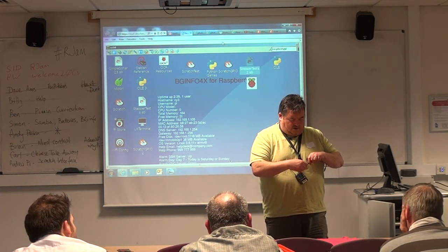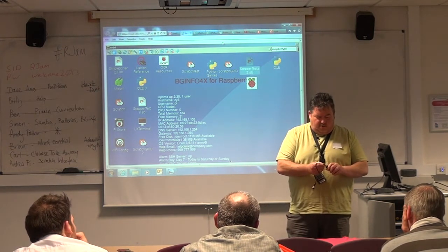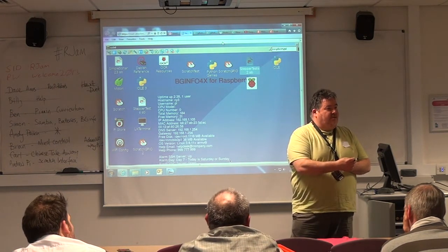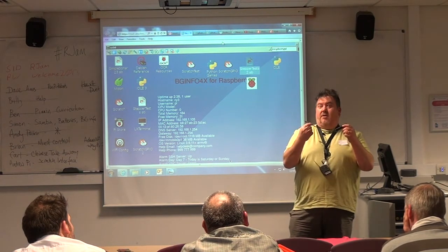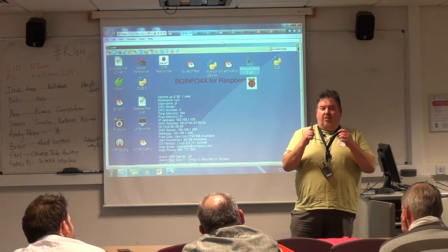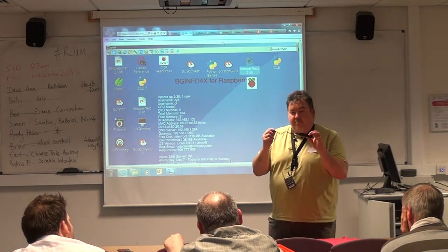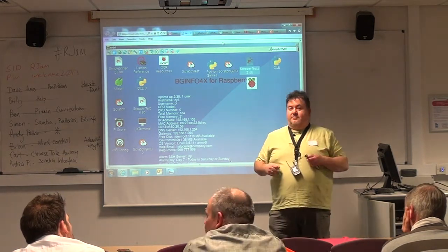If you can get these female-to-male USB adapters and plug them in, you can use a battery or even a normal power supply and power through the front USB ports on your Pi, which don't go through the poly fuses. This is a much safer way for a normal person to get all the current at the right voltage into the Pi without playing around with GPIO pins. If you put in a powered USB hub you can usually power through that as well.